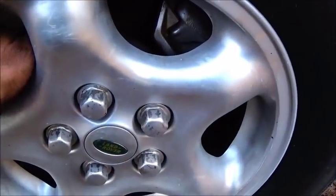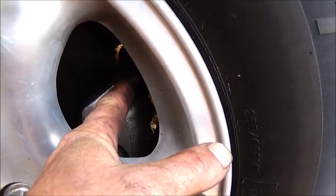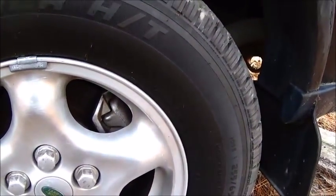This may work better. This is the rear of a Range Rover. It's single thickness, and there's not much space. I'd say it's about an inch or maybe less between the outside of the caliper and the rotor. We'll see how this is set up. All right, we've got a rubber line with a banjo fitting. It wouldn't be bad. The bracket would unbolt from the inside and stay on there with the slides. This is a little bigger rotor, so this might even be better. We can deal with the banjo fitting. Actually, we could maybe use the rubber line and then come up to the steel line.